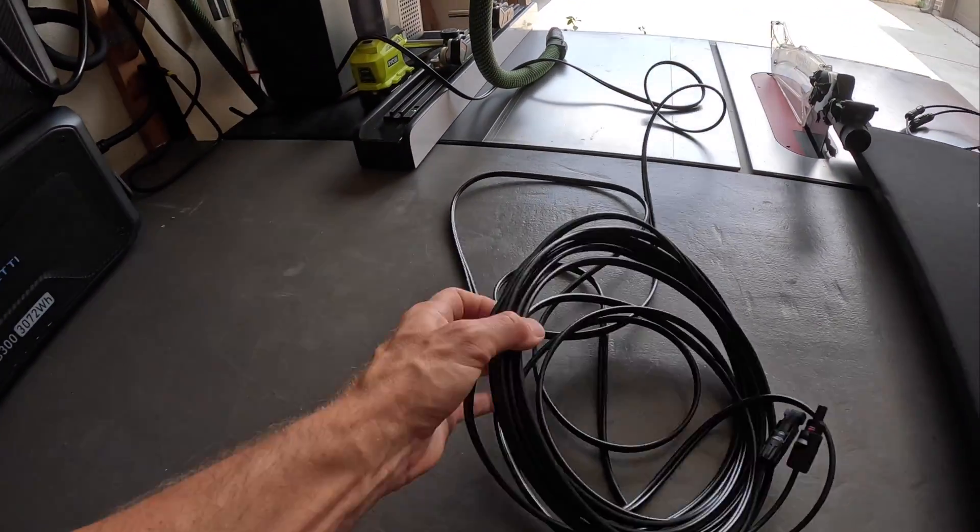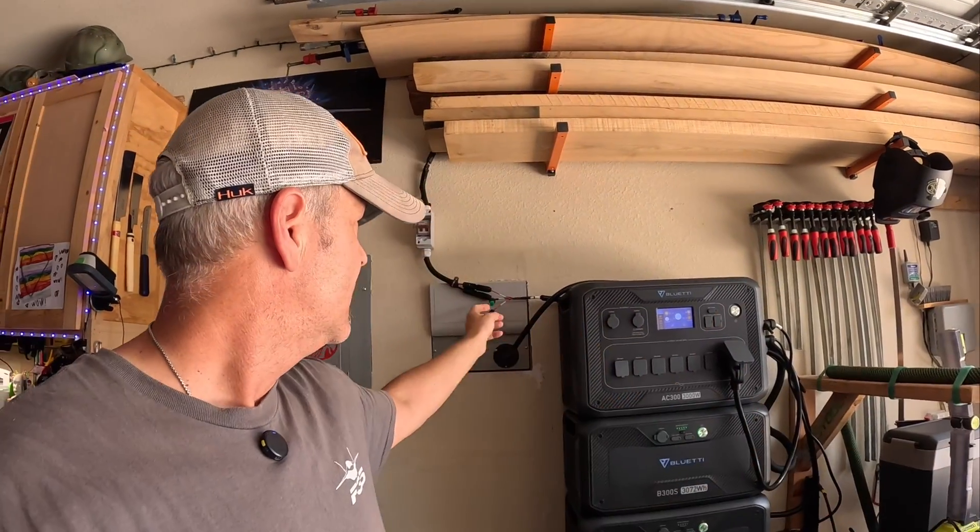Next video I'm going to show you folks how I'm going to put the 400 watts worth of solar in the backyard and how to get that wiring done. I'm actually going to be using 12-volt landscape wire. It is much cheaper than PV cables — this 12 gauge landscape wire is rated for 1,000 volts or 20 amps, so it's more than enough for 400 watts. I bought 100 feet of it for around $55, which is half the cost of PV cables, and it's a little easier to run because it comes as one string. You do have to install your own MC4 connectors, but that's simple. It's rated for direct burial. I'm going to bury what I can in the yard, run it up the side of my house, through my soffit, through my attic and down behind me, and connect it to the second string of the AC300 to effectively give me 1,200 watts worth of solar.